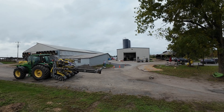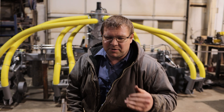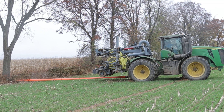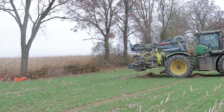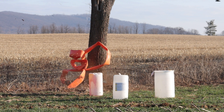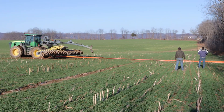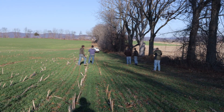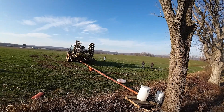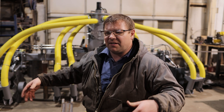The bolts breaking didn't hurt the swivel — it was just the six bolts that sheared off. So if you're using one of my pieces of equipment and the bolts break off, they break at around 21 tons. That is right up at your breaking strength — about where your hose is going to tear off on new hose. If you take drag hose and tear it off, what we've found with our testing is it'll tear at roughly 45,000 pounds the first time. The next time you cut it back a couple feet, it's going to tear off 20% sooner, because you have cords tearing internally. If you watch some of my other videos closely, you can see the cords going through the white cords in the air as it rips apart.